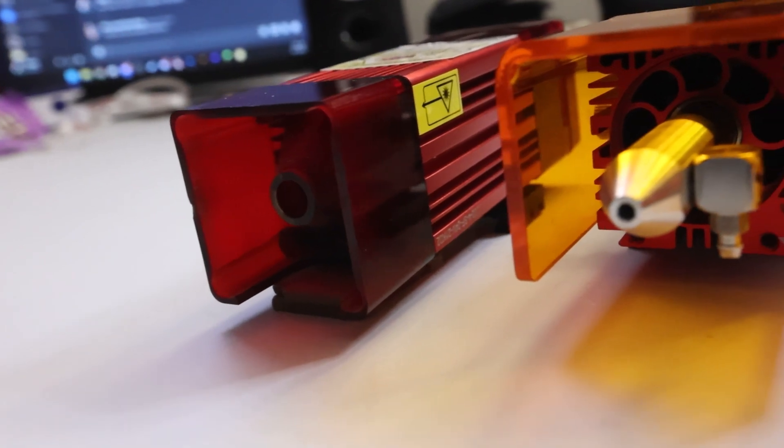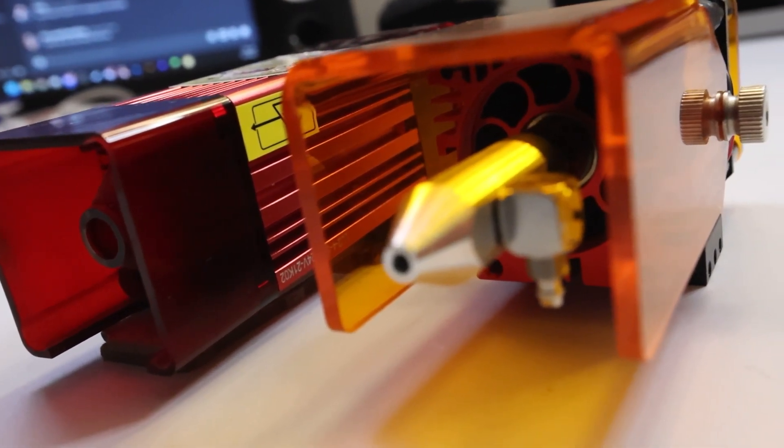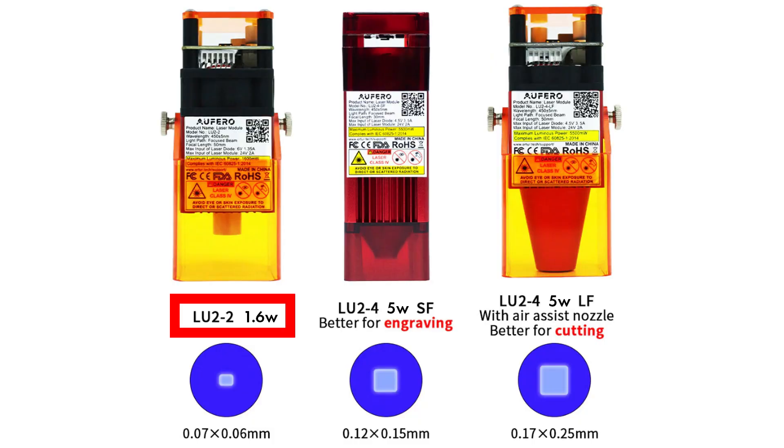Use of the 9th generation motherboard means that you'll have your choice of three new next generation laser modules — and these modules are badass. They're all cutting edge and each has its own primary function that makes each module excel at specific tasks. Your first option is the LU-2-2, which is your detail and precision module. It's unique due to its smaller luminous cavity, capable of significantly smaller dot sizes, with a spot size of approximately 0.07mm by 0.06mm. This module is going to be perfect for photo work and other high detail projects. The trade-off is you're only working with 1 to 1.6 watts of optical power, so it'll struggle with tougher materials like stone and thicker coatings and paints.